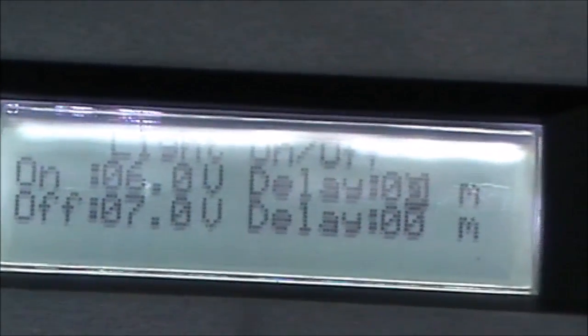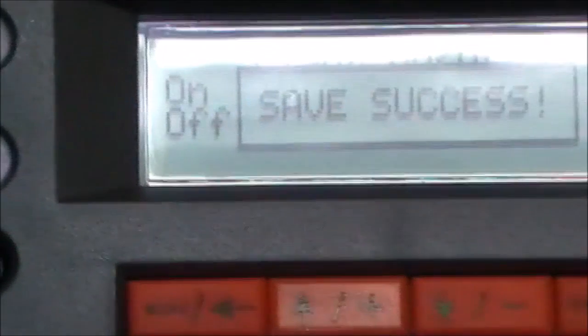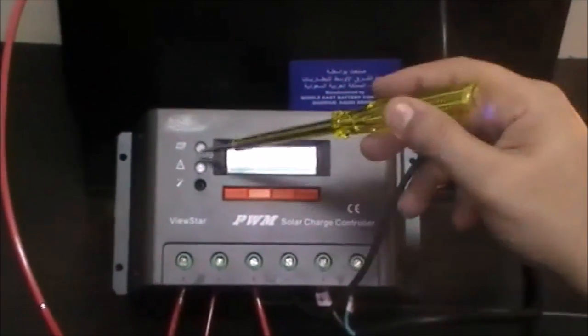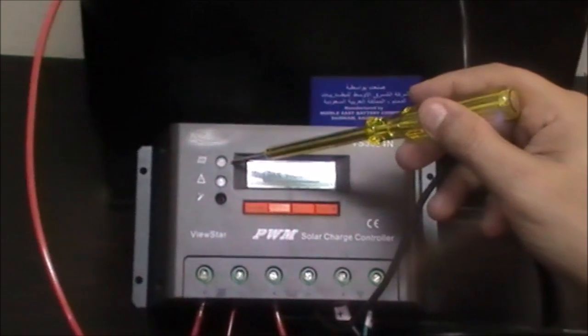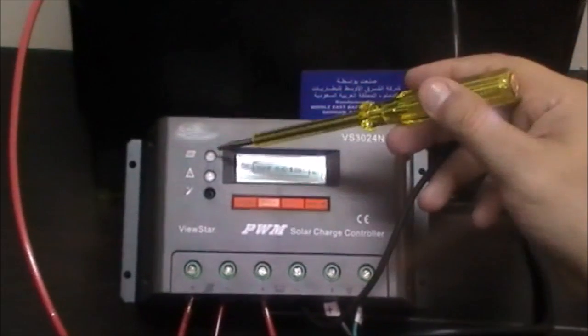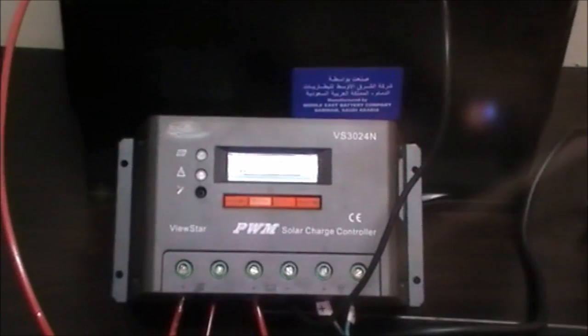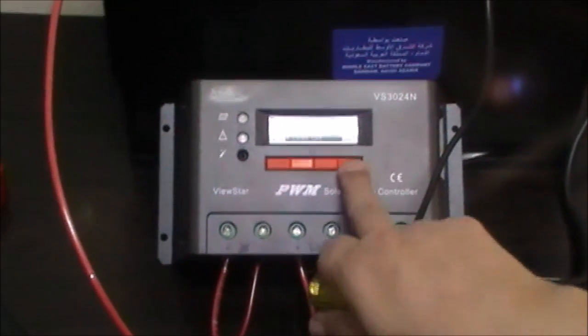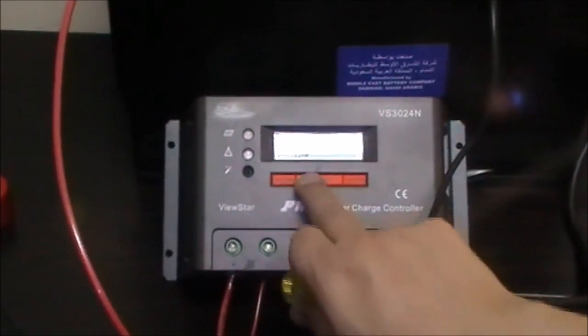Selecting light on/off, we can look at the load — yes, it is being turned on, meaning the light is being turned on. What I did was change the programming in the charge controller so that when the panel is not charging — meaning it is nighttime — only then will the load be turned on. So the load turns on only when the solar panels are not charging the battery, meaning it is nighttime and I need the lights on.